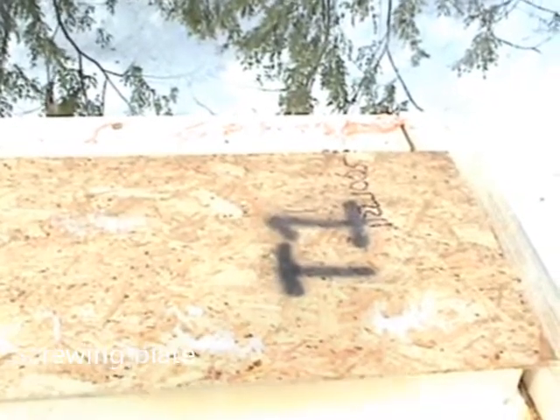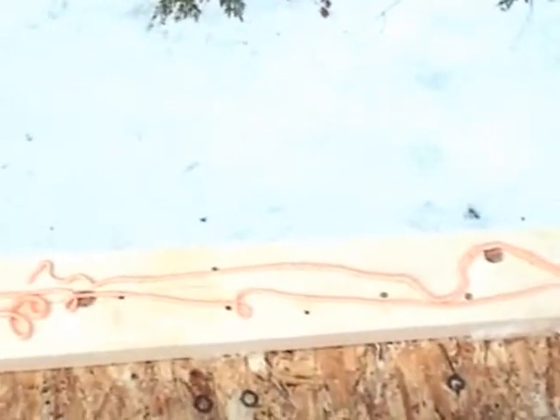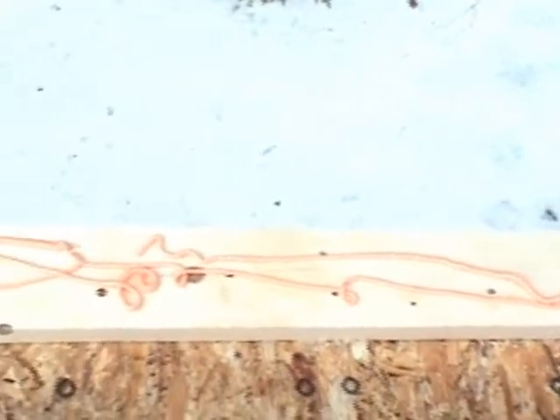Here's our Mira Structural SIP panel. It's actually lying on the deck at this point and Jimmy has just gone down the plate that we saw a minute ago and put another bead — actually two beads — of foam. The bottom of the SIP panel has all been routered out at the factory and will sit right over the top of this two-by-six panel, thus securing it to the deck.